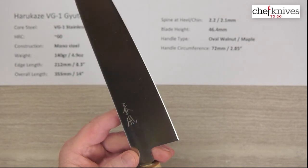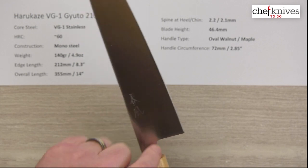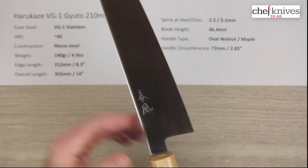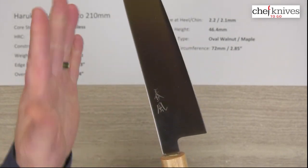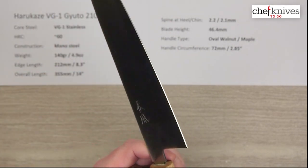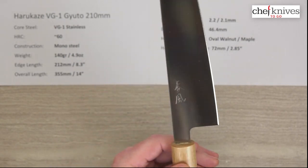So if that's the case with you, you can get some strips of sandpaper, emery cloth, do a shoe shine on this back and forth, and if you tape it correctly, put it in some kind of clamp and tape it so it's protected. And you're protected. I usually tape the top part too so you don't get hit with a knife edge, but you could knock this out in 10 minutes easy and have a nice finish on that and smooth it out.